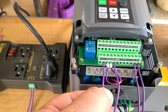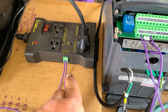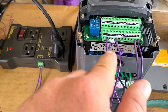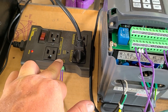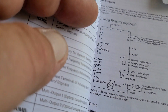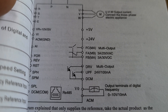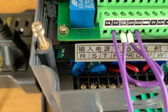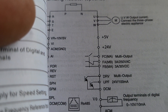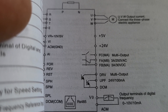It's set for number two. FC is an output which goes to the positive side. DCM goes to the negative of the IOT relay. And then FC, which is the 24 volts going through, out goes on the positive. There's your little relays — the 3 amp, 0 to 30 volt DC input is FB. FB is receiving that 24 volts in. And then FC is normally open and closes, depending on whatever I set it to do.